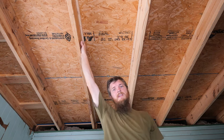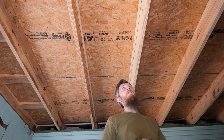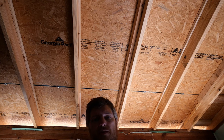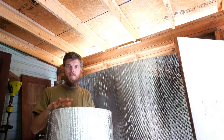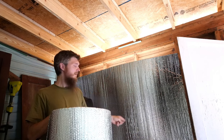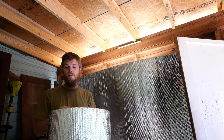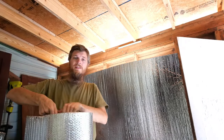I don't think furring strips are strictly necessary for this job, but it's going to make it easier and I have them, so I'm going to use them. I could just staple the bubble wrap right to the sides of the joist if I folded it a little bit, but I figure might as well throw them in there. Alright, we got all of our furring strips up — you can see them on the sides of the ceiling rafters. Now it's time for the bubbles. Our bubble radiant barrier is four feet wide, so it obviously isn't going to fit in the bay. We have to cut it down to two feet. I'll cut them a piece at a time just in case it goes wrong.